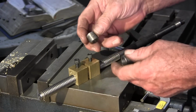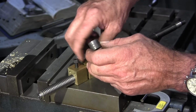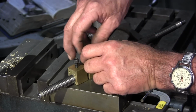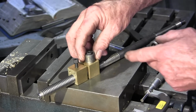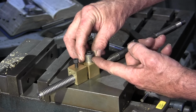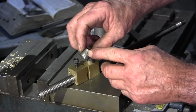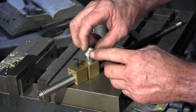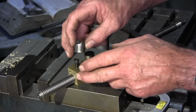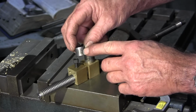Okay, the last thing we want to address with our nuts is these two round posts that mount these to the cross slide. They're for full adjustment, even up and down, and there's set screws that come in and lock these as far as the height up and down, and there's little digs in here where the set screw cup point digs into. If you wanted to make a difference of up and down adjustment, or your ways are being scraped, and we're definitely in a different spot with new nuts, new ways, and everything else, we want to rid of that.